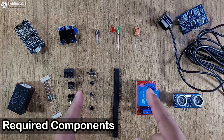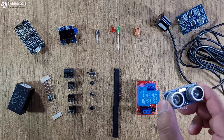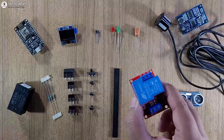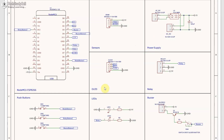These are the required components for this project. You can either use a waterproof ultrasonic sensor or HC-SR04 ultrasonic sensor. To control the pump, I have used a 5-volt 30 ampere relay. Now you have to connect all these components as per the circuit diagram. The circuit is very simple — you can download it from the video description. You can directly give AC supply or 5-volt DC supply to the circuit, and here you have to connect a 5-volt active high relay module to control the pump.